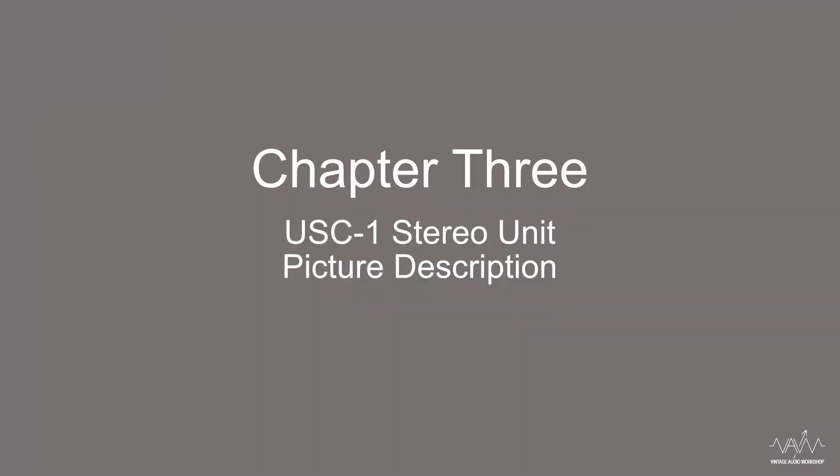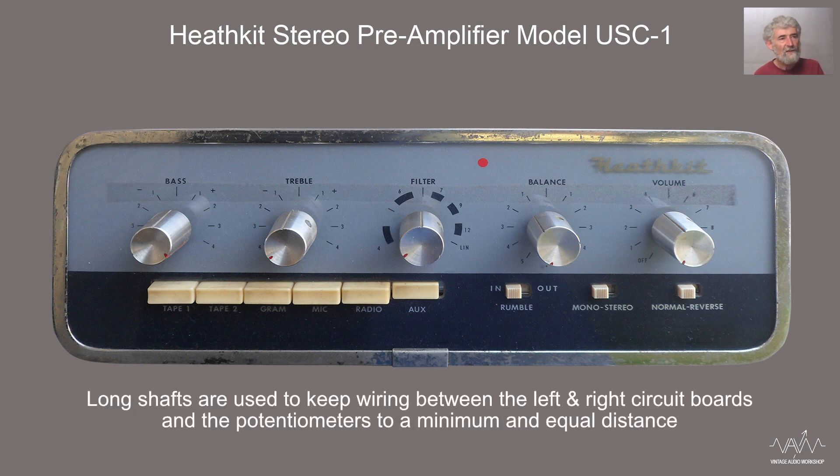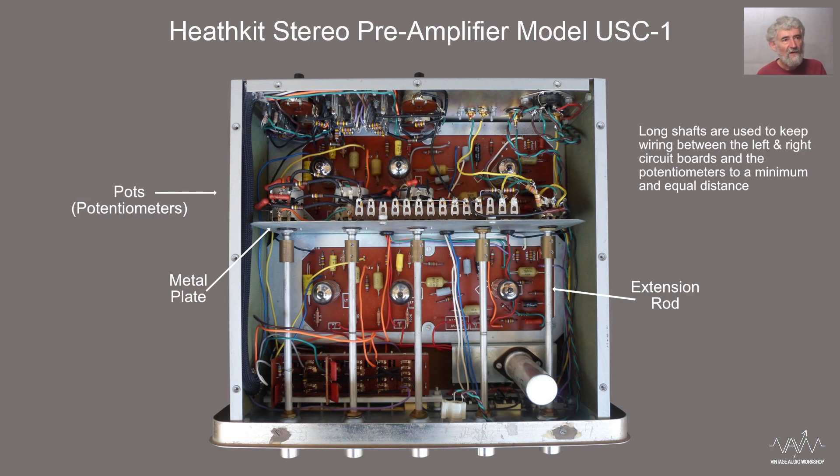In the next picture you will see the stereo version. That is very similar in circuit but they're not identical. They also needed for some reason to move a lot of the controls away from the front panel, and there is a metal plate with extensions on the pots, taking the knobs through via shafts to the controls. With its six valves - three per channel - it is actually more complex than the mono, and also it relies on push buttons for input selection.